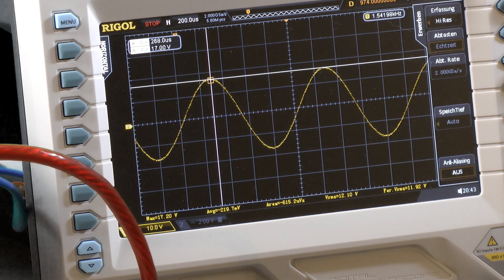What I can say is the amp is not able to put out power at 1 ohm continuous — it only delivers around 45 to 50 watts. Dynamically I got around 17.2 volts peak and 12.1 volts RMS, which equals 147 watts dynamically at 1 ohm. I will say minimum load for this amp is 2 ohms.